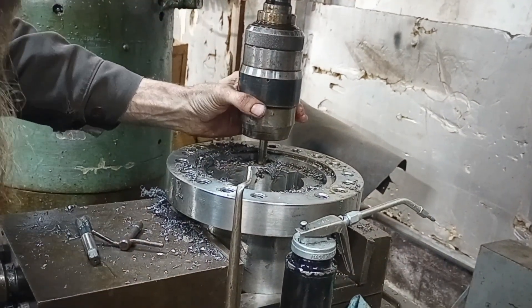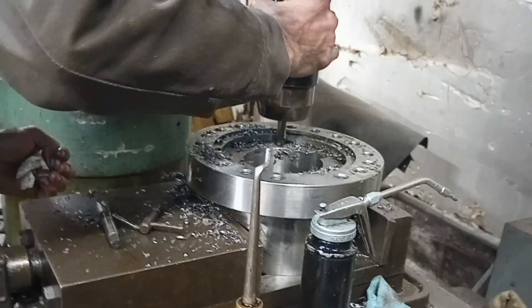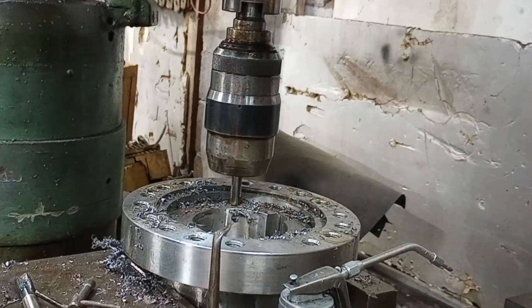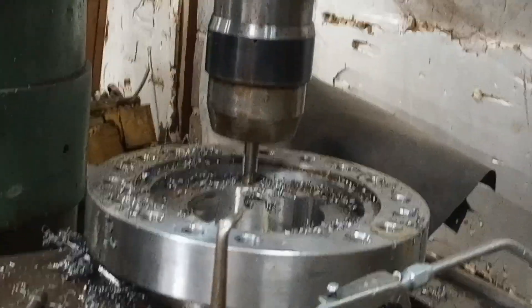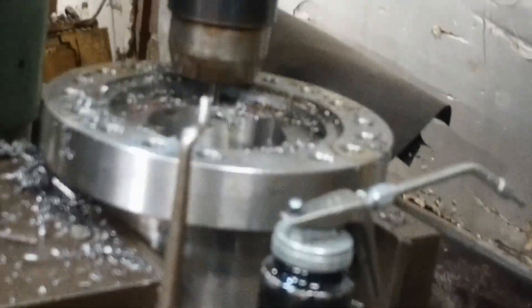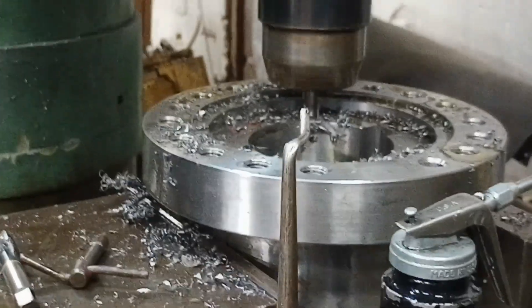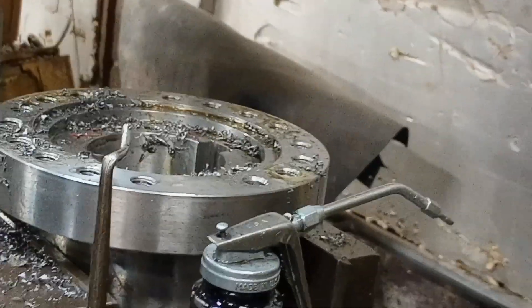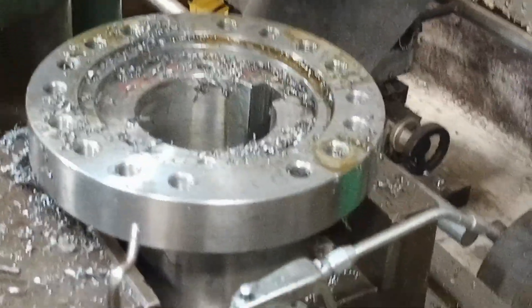I had been playing with the slip clutch mechanism. I'm going to set it to three-eighths here once. There's the slip clutch spin — I had her set to quarter inch, I just wanted to make sure it was actually going to stop. It wasn't sticky, but pretty dang slick. Those are blind holes that I just ran. Possibly the coolest tapping attachment I have ever laid my hands on.